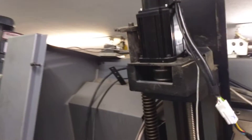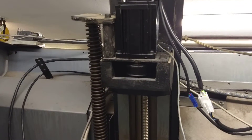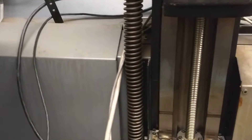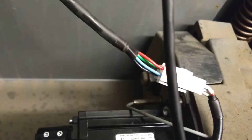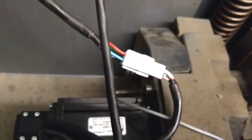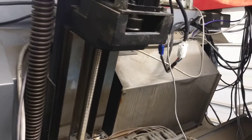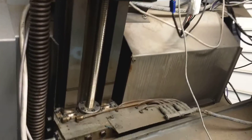I've got the Dyn4 AC motors mounted up on the X and the Z. I'm probably going to use the proximity sensors that are already on the X and Z axes to home the machine. If I can't use those — I believe they're 8mm — I'll swap them out with something else, since I don't know what signal levels are coming out of them. I'm going to guess it's probably 24-volt signals; I have yet to test them.